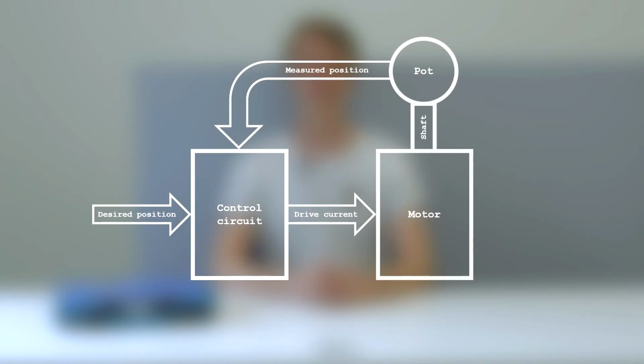The potentiometer and chip implement the closed-loop control system using negative feedback. The reading from the potentiometer is passed to the chip and compared with the control signal. An H-bridge is used to set the direction of rotation according to the difference in the signals. If the two signals differ, the shaft is moved, and if they match within the limits of the so-called deadband region, the shaft stays still.